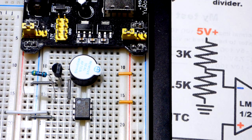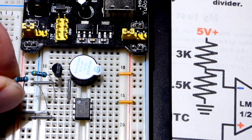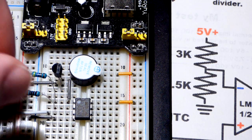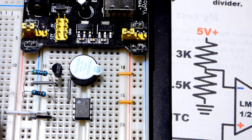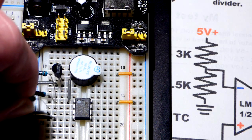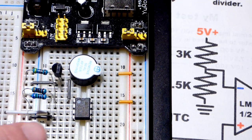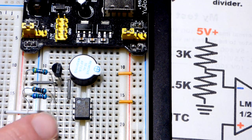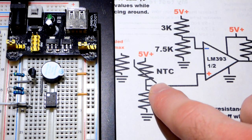The inverting pin voltage divider: the 3 kilohm resistor goes to the positive rail and then over to the inverting pin — that's the second pin down. I'll squeeze in a second resistor going to the negative rail. These two resistors can touch each other as long as their individual leads don't short. With the 5 volt power supply, that'll set the inverting pin to practically spot-on 3.6 volts.